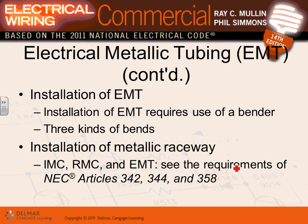All conduits come in ten-foot sections. EMT cannot be threaded by code. There are three types of benders for EMT: hand benders, electrical benders — which go up to about four inches — and hydraulic benders, which get you up to six inches. For rigid, most people use pre-manufactured bends because it's expensive and hard to bend in the field.